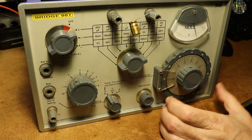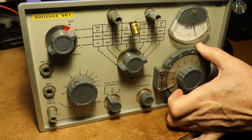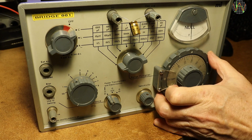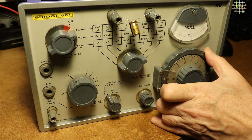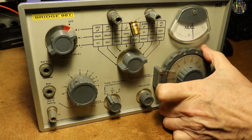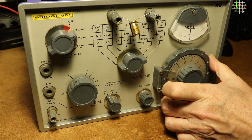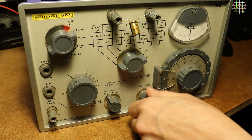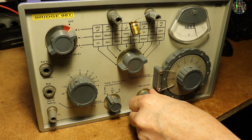And to try the outer ring of the balance control. The current value is shown through the clear window with a horizontal line on the left side of the knob. Going backwards and forward a bit, the 0.2 position gives the lowest deflection. Time to increase sensitivity again.